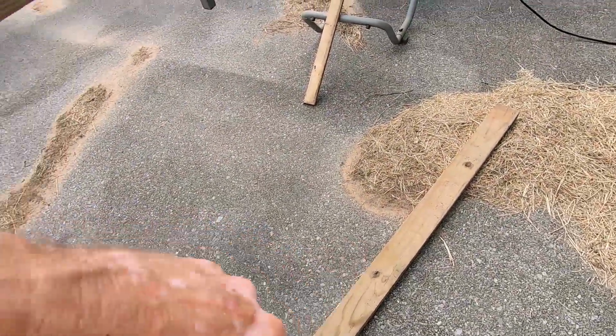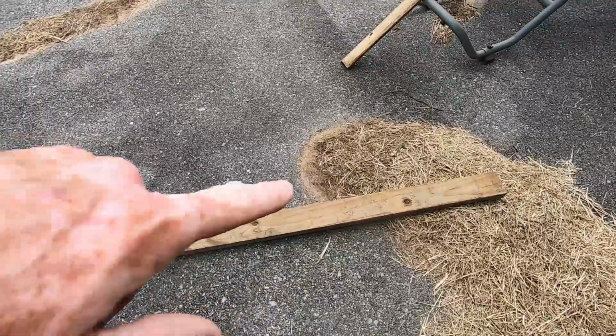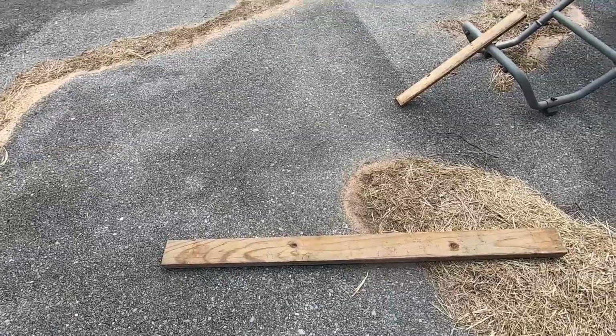All right, so we're going for an overall outside of 6 feet with the 3.5-inch 4x4 post. That leaves us inside of 65 inches. So I've cut the first one and getting ready to cut its mate. Then I will make one solid piece out of it with a few screws, put it across the back, and then I can take that little tacked on board out so we can get started on the rest of it.